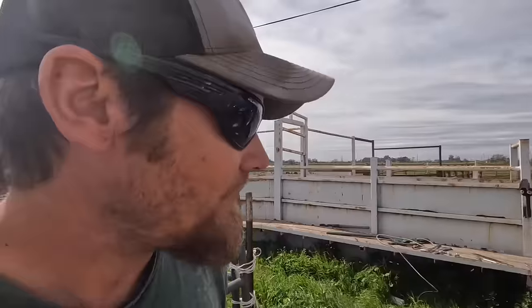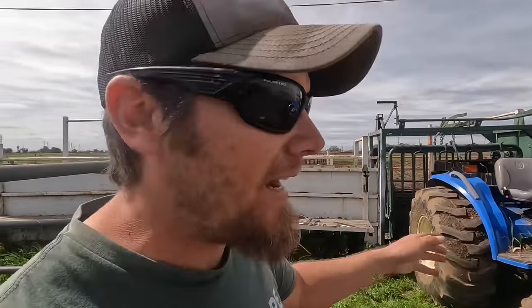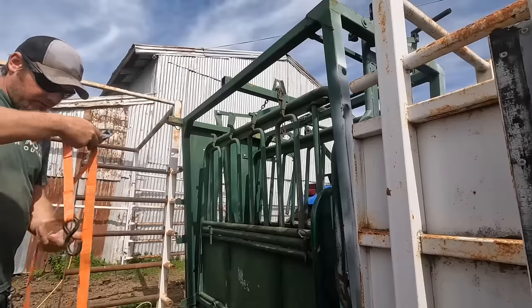I think I've got the chute balanced pretty well — the front is a little heavier because of the head gate, so I've positioned the tractor slightly towards the front but more or less in the middle. The difficult thing about three-point forks is the tilt, so I'm constantly adjusting the top link. The tractor isn't sitting flat right now so it might be leaning towards me once we pull up out of this hole. I think I can get some straps on this and tie it down, then attempt to lift it up and pull it out.